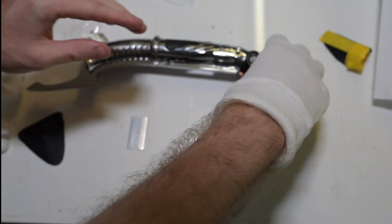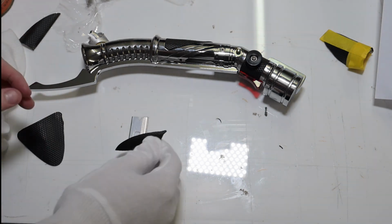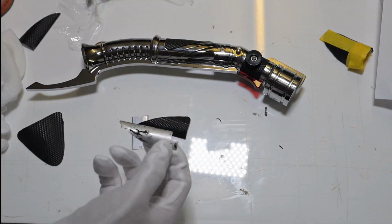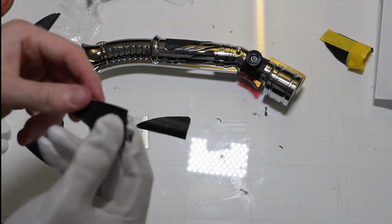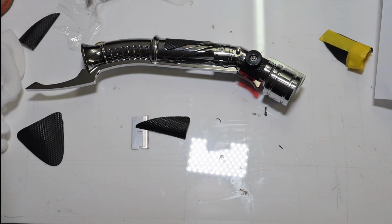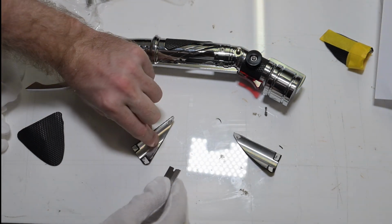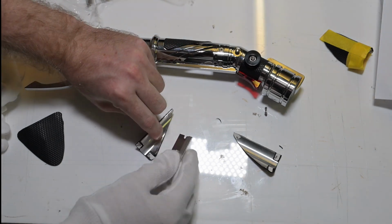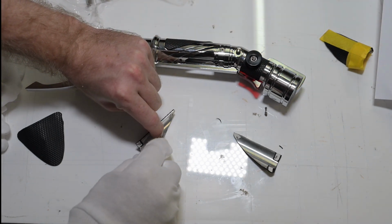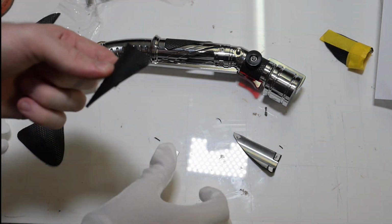This same process can be repeated for these sides. I've got one here, same thing again. You would take your contact adhesive and re-glue this on. And I've got one here which has a slight overlap. You'd place it down onto the table or a cutting mat with a small razor blade or an Exacto knife, and just trim the tiniest little bit off.